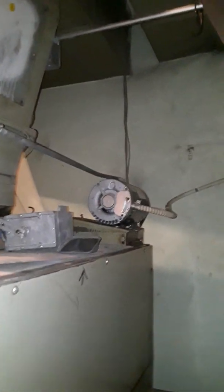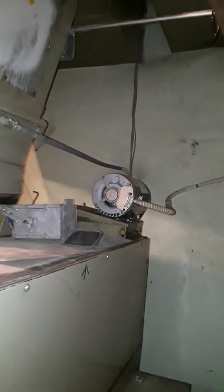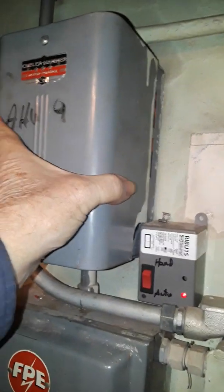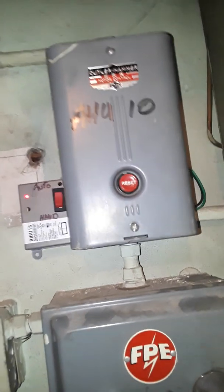We'll get the horsepower off the smaller number nine from the blower to see what it's rated at — it's on the back side over here. Fairly small motor, so I imagine it's a horse, horse and a half, something like that. We'll see what it is. We'll upgrade motor starters if they haven't been. This one looks like maybe it has been — yeah, it has, so that's a good sign. That's probably the old one still on number 10.